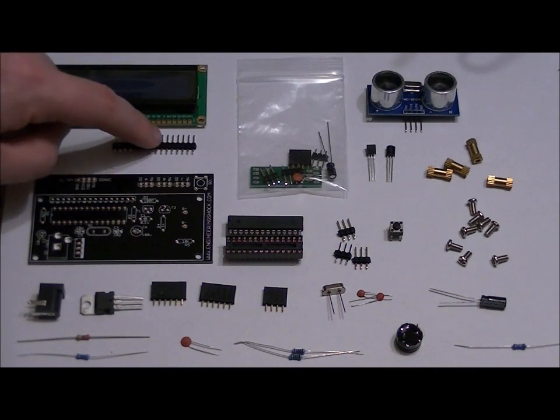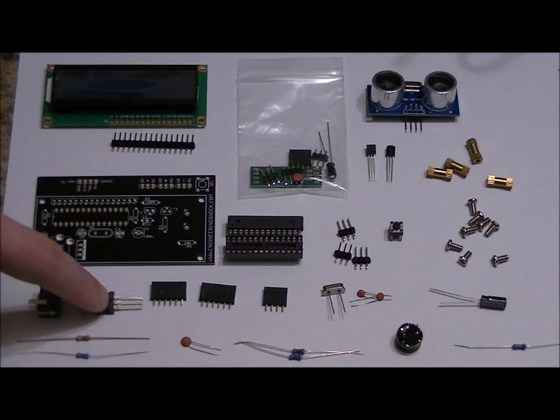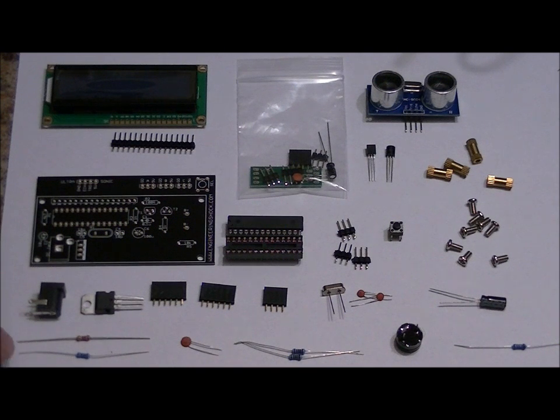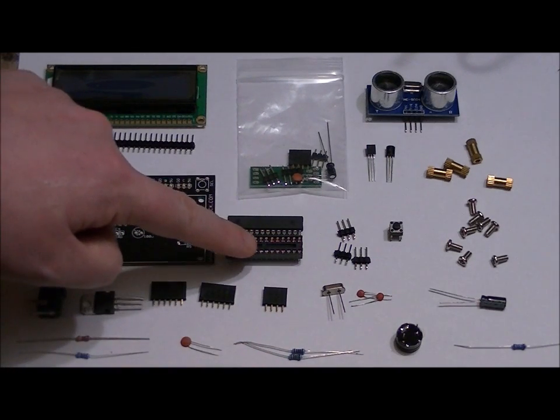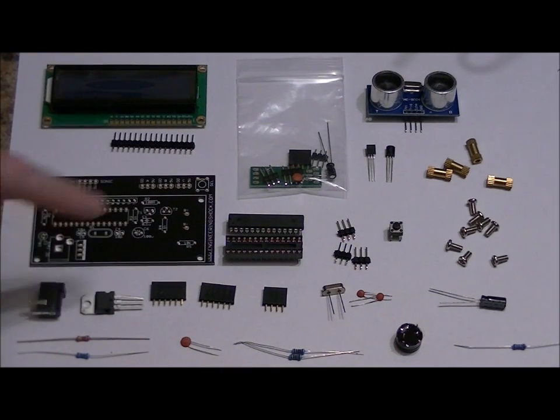1602A LCD with 16-pin header, custom printed circuit board, 5mm power jack, 7805 5-volt regulator, a 2.7k ohm resistor, a 100 ohm resistor, a 0.1 microfarad ceramic capacitor, two 10k ohm resistors, an active piezo buzzer, a 10k ohm resistor, a 100 microfarad electrolytic capacitor, two 18 picofarad capacitors, 16 megahertz crystal oscillator, a single female 4-pin header, two female 6-pin headers, a 28-pin DIP socket, Atmega 328 PU programmed microcontroller, same used as in Arduino,